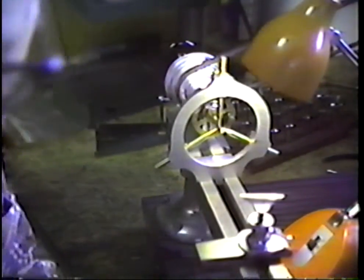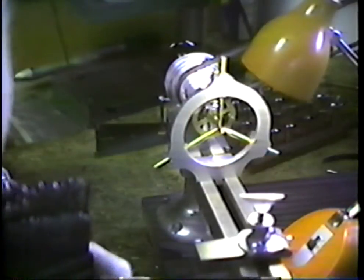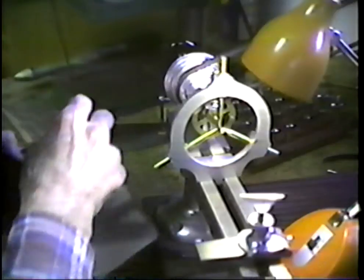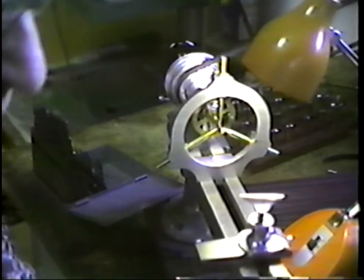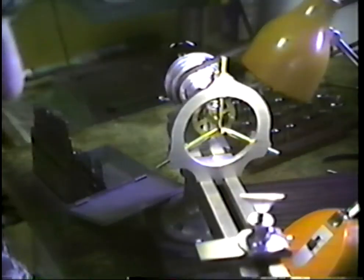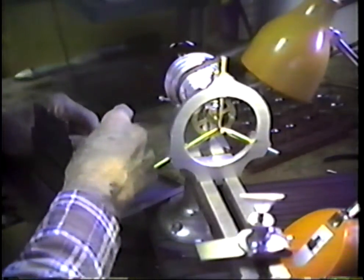I suppose it's in the order of possibly 75 thousandths of an inch. I don't know. Let's pull out a bit here that says 76 thousandths of an inch. See how it fits to that hole. Well, that's pretty close, but the hole is smaller. I can't put the chucking shank of that bit in that hole. Let's back down another.